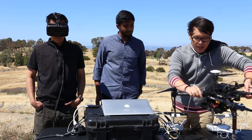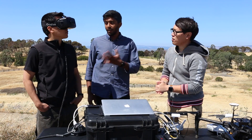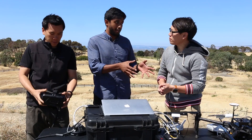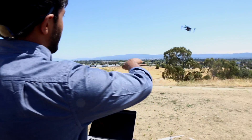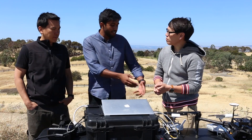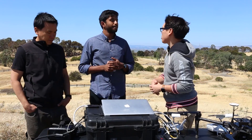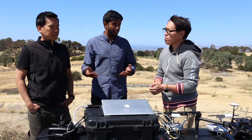Now, because the SDKs are similar, is this something that could also be ported to the Inspire? We've actually tested on the Inspire, and it works great — very few changes to get it working on the Inspire 1. The second tech demo is the Leap Motion, this little box here. It's flight control using just your hand and the Leap Motion to actually fly the aircraft. While the Oculus lets you control camera movement, moving your hand on top of the Leap and imitating an aircraft, you can actually fly the M100. If you think of your hand as the aircraft, you can pitch it forward, tilt it back, go higher, go lower — without the two-stick setup, just using your hand as the control interface. It's an example of what you can do, and it's up to people who want to use this commercially to figure out the best integration of camera and control systems using the SDK.